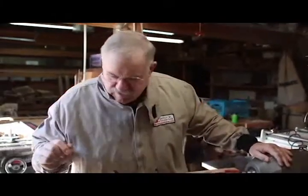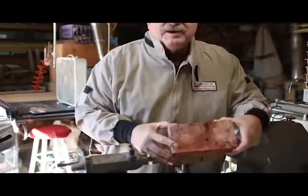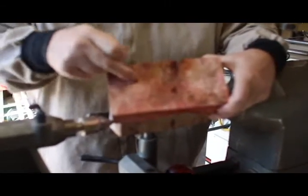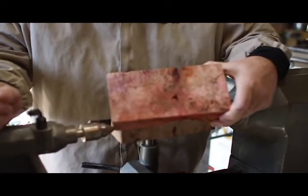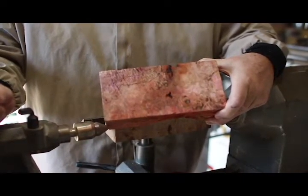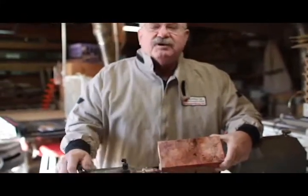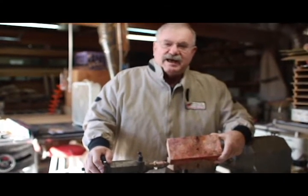Well, first of all, unfortunately, some of the prettiest wood that we can find is more like a bundle of newspapers than a piece of wood. By stabilizing, by embedding this area, pieces like this, with a plastic resin, we can harden that so that it can be turned or worked with in other woodworking methods, and you wind up capturing that beauty. And as you notice, this is red. You can also add color to stabilized wood that gives you a little bit of extra accent.